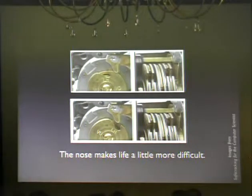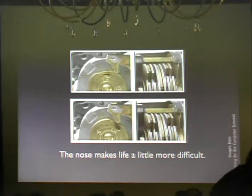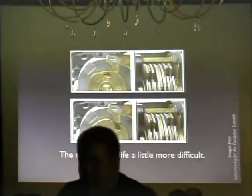The long and short of it is, unless the spindle of the dial is in one particular place, the fence doesn't touch the wheels, which means that no matter how hard you crank on the handle of the safe, in fact, most safes don't even have you ever touching the actual bits of the lock directly. It's all interlinked by mechanical linkage. Except for this one particular place on the dial, the fence never touches the wheels, which makes it kind of hard to figure out where the gates are in the wheels if, for most of the revolution of the dial, the fence is never actually touching the wheels, and so therefore you have no way of getting information about the state of the dials underneath the fence, except in that one particular place.